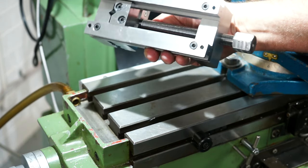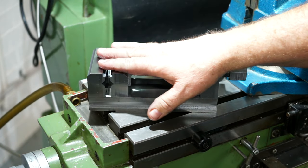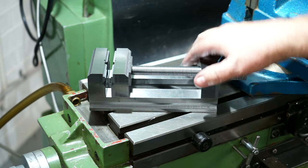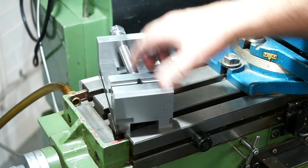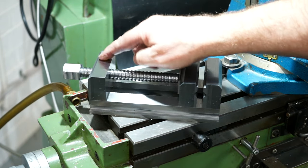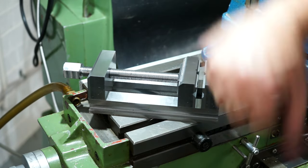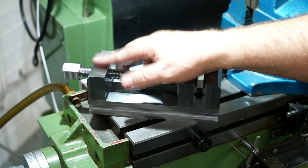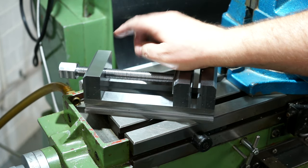I've given it a little bit of a surface grind here and there — I couldn't do it all. At work we've got the big surface grinder and I could grind that no problem at all. My little tool and cutter grinder struggled a little bit to do the top of these. You can see a little blemish there where the traversing arm — the X-axis — bumped my leg and made the wheel jump. I just have to take a little bit of wet and dry and polish that out, but I'm not bloody happy with it.